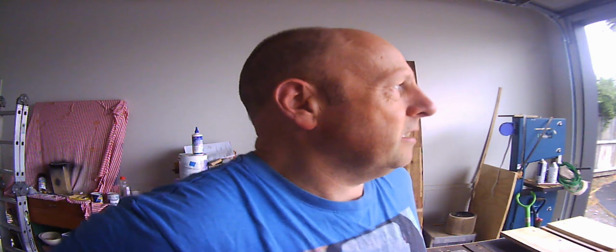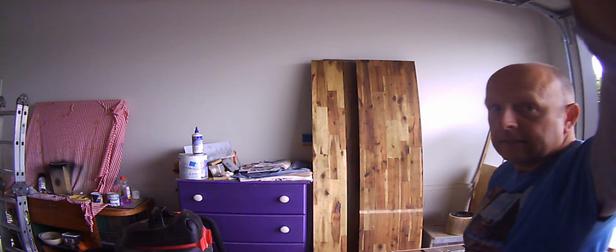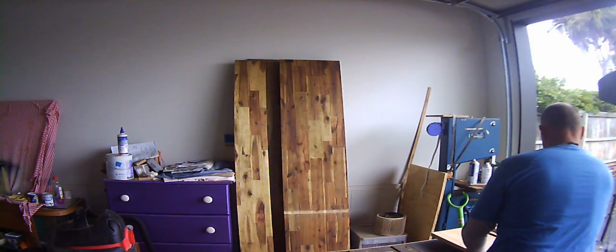Okay, so it's another wet day, so I'm going to carry on with my shelf and my desk build. I tried just routing one side of the shelves at once. Got 2 slots done. It was taking for absolute ever, so I just built a quick jig. Just a quick dado jig, nothing special. This one's not adjustable, this one's fixed.